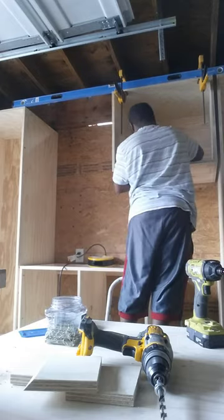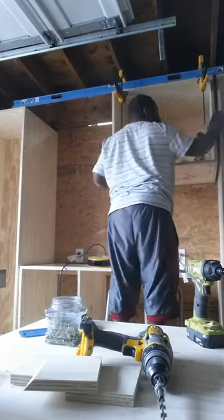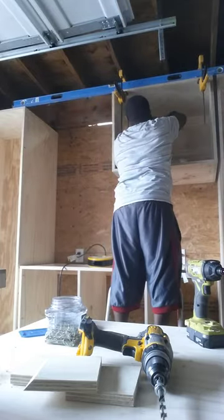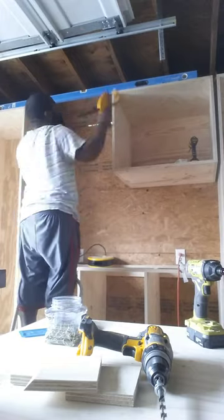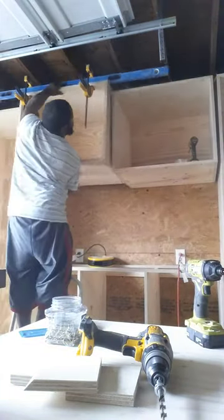If you're attaching a piece of wood, at least like a one-by or something like that, screw it to the top side of your cabinet. Make sure your screws don't blow through the top of your cabinet obviously, but screw that board on and then you can span it across two other cabinets — whether they're two upper cabinets or pantry cabinets — to help support it, and then you can go into your screwing process.